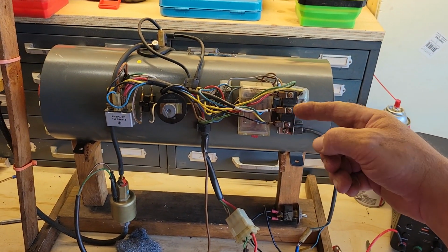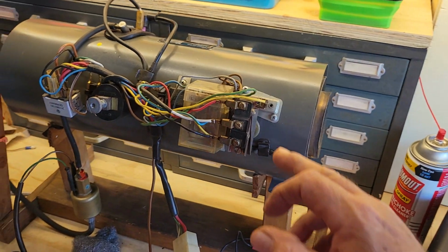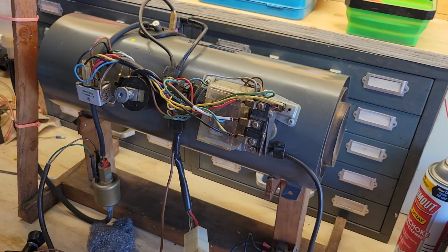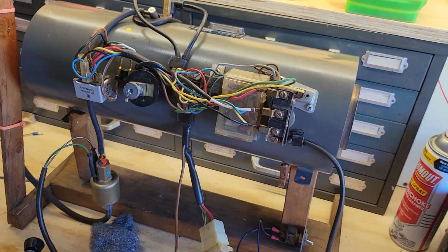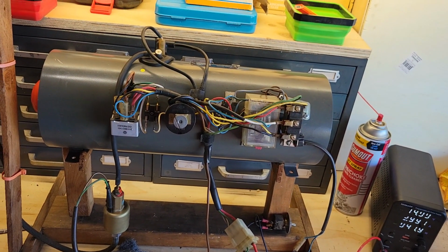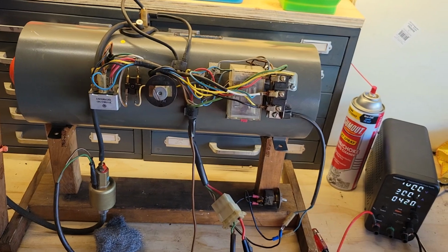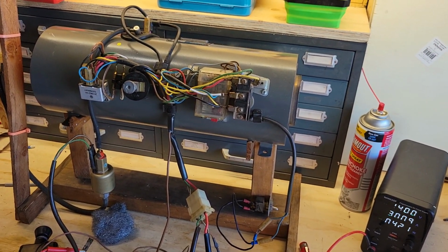What it's doing is cooling the rod that's inside the ignition chamber, the rod that goes down in here. It's cooling it off to the point to where it will shrink back down. Actually, that shrinks down, and it'll trigger that little switch. It still might be sensitive because it's like a 75, 80 degree day here in San Diego, so it's hard to get these to run properly when it's not 45 degrees outside. This ambient temperature does affect tuning these to a certain degree.